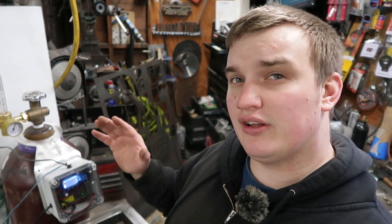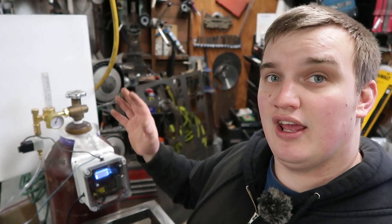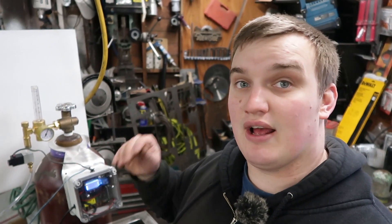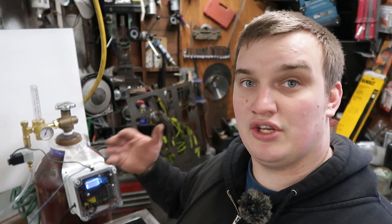There are a couple of other things I want to tweak. Number one is that switch on the pedal — I'm not totally in love with it. I'm deciding if I like it actually on the pedal itself, or if I want to make a second separate pedal that I hold down just for the purge. But it is super nice to be able to hit that and just pre-purge the whole unit ahead of time and then start welding. I have it set for 10 seconds now, so it'll run for 10 seconds after I let off that pedal and continue a little post-flow as that weld cools down.